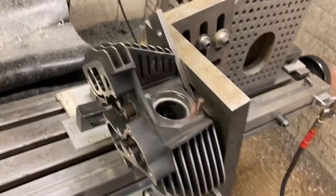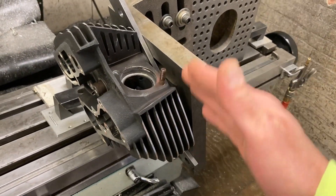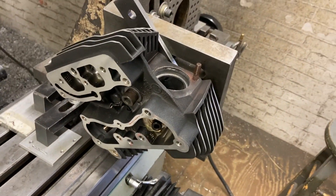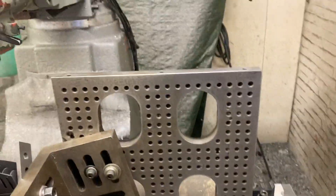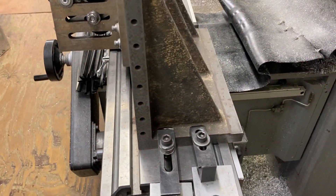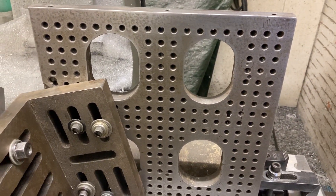There's a compound angle going on — this way and this way — so I had to figure out some way to mount it. I had to think about that a little bit, but fortunately we've got a nice surface here that banks on the cylinder, so that's the mounting surface and we know that's flat. I got this big honking angle plate — knee, whatever you want to call it — bolted it down nice and tight, indicated it straight. It's got 3/8" tapped holes all over the place, giving me a lot of real estate to screw to.